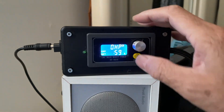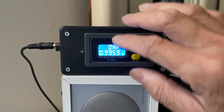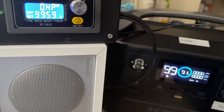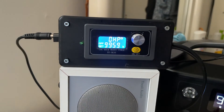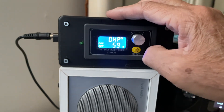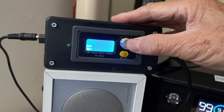This is the screen and this is the number of hours I've set it to — 99 hours, the maximum. If you set it to a lower run time, say 10 minutes, then after 10 minutes it would shut off. If you're using it as a power supply your radio will shut off and you might not know what's happening — you may have inadvertently set the run time too low. So I've set it to 99 hours, which is good for charging as well as operating your devices.